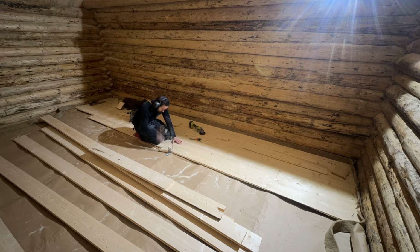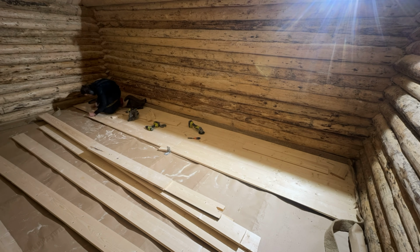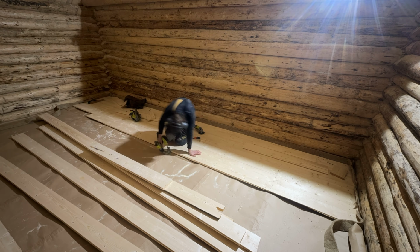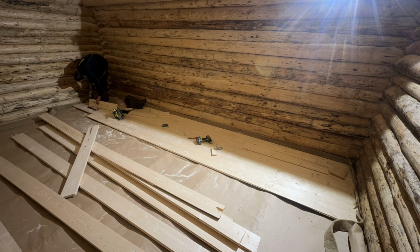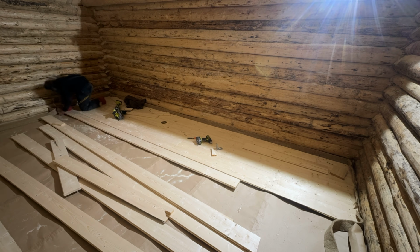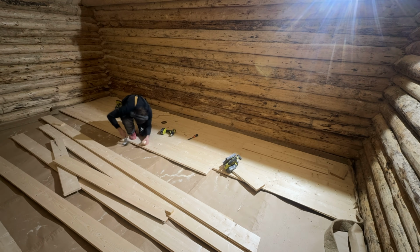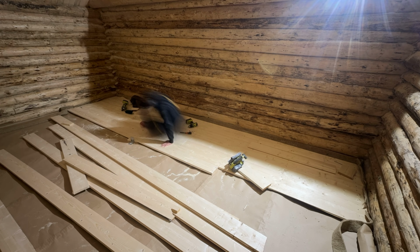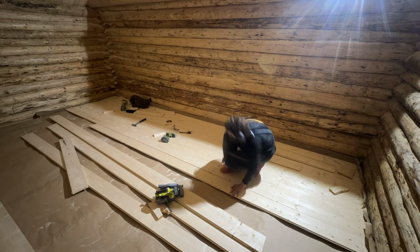When you treat spruce boards with oil wax, it hardens and it can still have a really long lifespan. All these things together made the choice easy for me to go with spruce. I also thought about fire hardening these boards, a method where you scorch the upside of the boards and then sand them down, which makes the board harder as well. In the end I chose oil wax, and that's because I have lots of things to do.